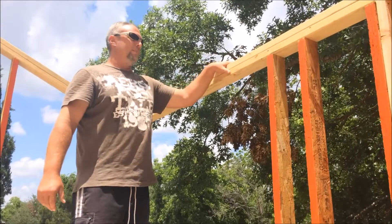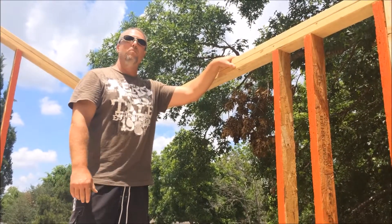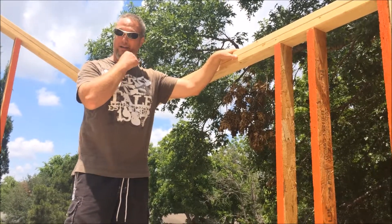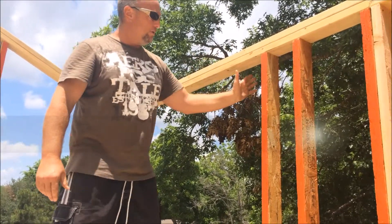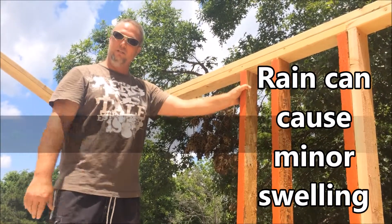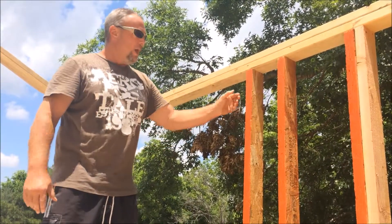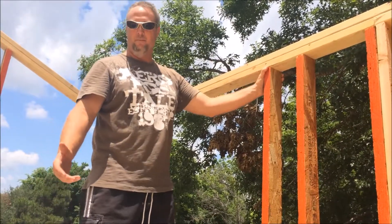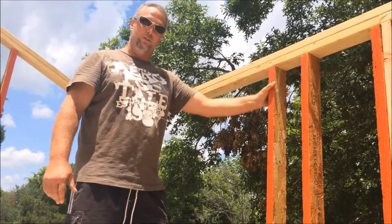If you're planning on having your house open for more than a month or two on a big frame where you're not going to get it dried in real quick, you might want to go ahead and open up your openings about a quarter to three-eighths more in case it does get some rain and you get some swelling. It will not pull moisture out of the air and swell up, but it will swell up upon moisture contact.